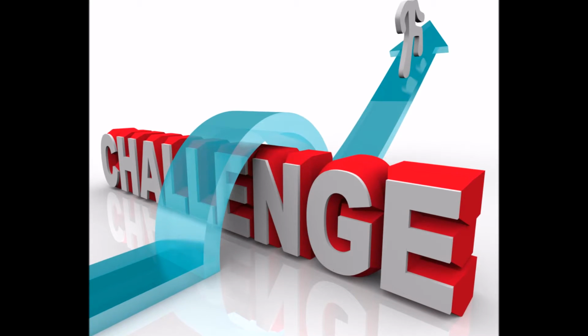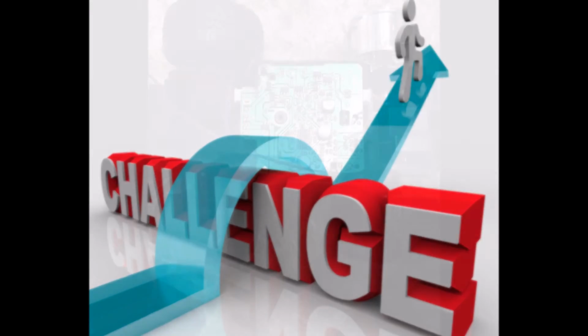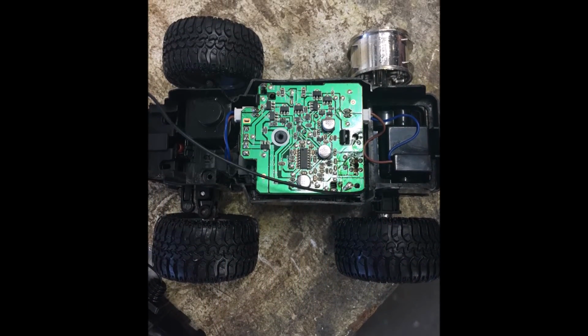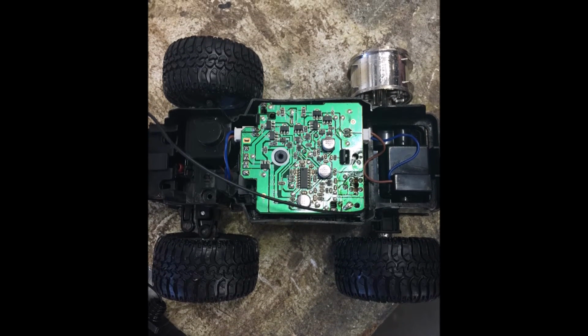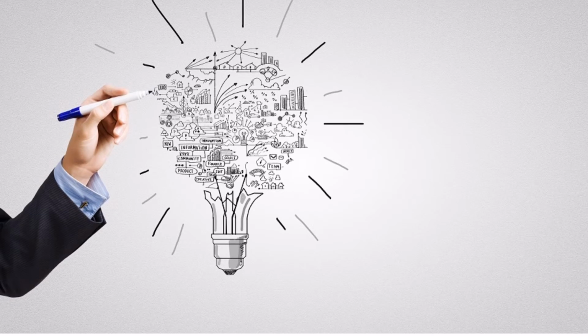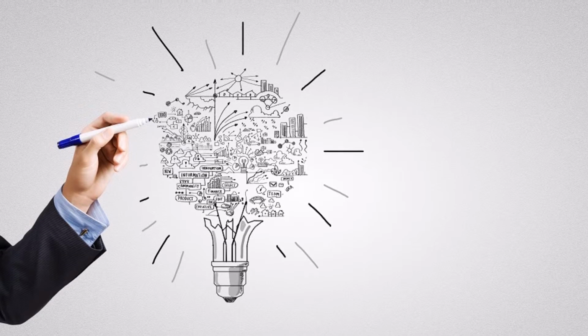The next was the strength of the motors. Because we didn't spend a whole lot of money on them, they were all fairly weak. That became a problem when we tried to connect the fishing pole that we originally had to the motors, and it was too heavy. We fixed this by using a straw, which was lighter and also allowed the line to flow through it. Secondly, when we added the clothes, they were also too heavy. We combated this by cutting out part of the shoulder and reducing the friction that the clothes created.